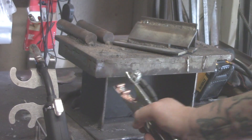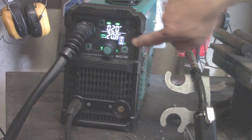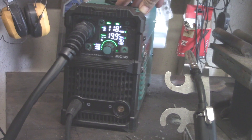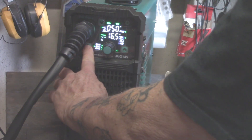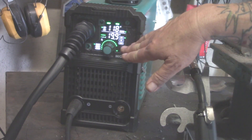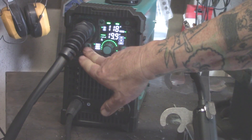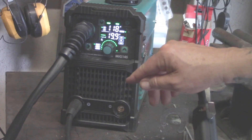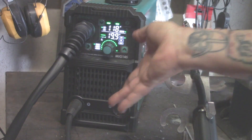Put your working clamp onto the surface you're going to be welding on, then set the machine to MIG. We're using 0.030 wire; you can scroll through the selection for 0.035 and 0.040. This welder doesn't have a lot of adjustment on wire feed speed, but you can play with your settings to get it dialed in and adjust bead height. The main thing is you need to master whatever tool you're using — it takes a little while to get used to the machine.